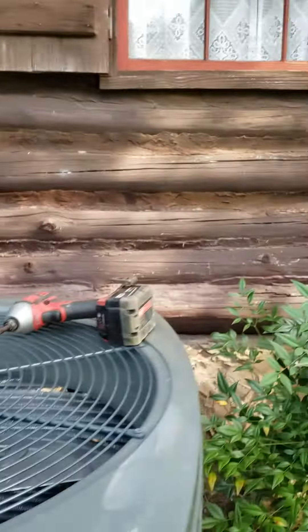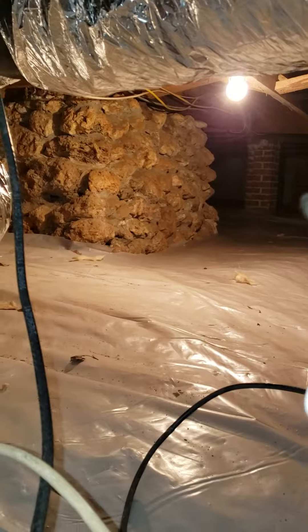We supported the drain line right there, supported the return, insulated. We went ahead and put down plastic — the moisture barrier right there. We changed this return to a supply duct, and two more back in the living room back there into supply ducts.